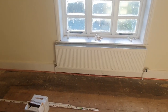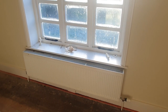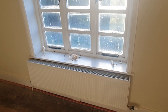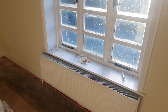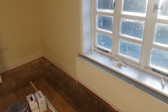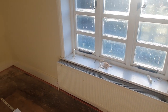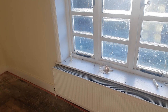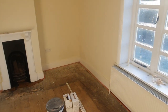It feels a lot warmer upstairs already - the boiler's only been on a few minutes. What you really want is to leave the heating ticking over so all the moisture can dry out. The trouble is with the building being sealed up, it never really dries out, so you end up with damp and condensation. There's a little bit of air in that radiator - we'll bleed that. I'm going to turn the stat to 20 and leave it coming on about three hours in the morning and a couple of hours in the evening so I'm not wasting too much oil.